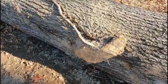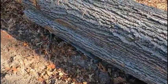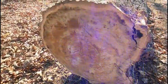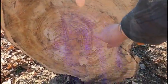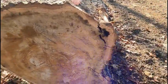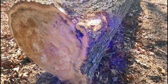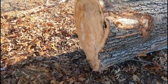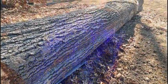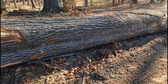That'd probably leave me around 14 foot, and I could do two 7-foot pieces. I still don't think I'd be able to lift it though — maybe as it dries out. But this also had oak wilt in it. I'm trying to see where it is — it's still a little soft here. The oak wilt is kind of right here. This piece split a little bit — you can see there's checking across here. I'm about a foot higher than where it was rotted out. It probably wouldn't hurt to take 6 inches off. I want to get this stuff milled so I can get rid of the sawdust before it starts getting warmer. I don't want this stuff to spread, so I want to get it done before March.